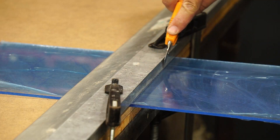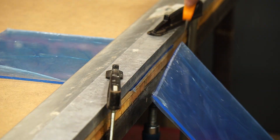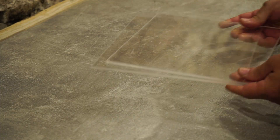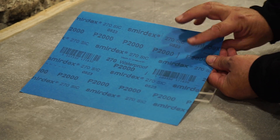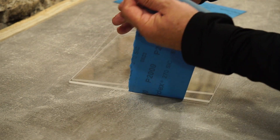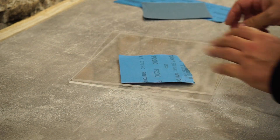For this purpose, I use transparent acrylic with a thickness of 4 mm. I also use two boards with a thickness of 15 mm. I sand the cut clear acrylic with 2000 grit and then spray paint with black matte.